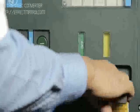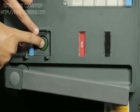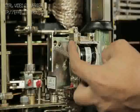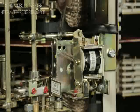For checking correct operation of the shunt release, charge the breaker. Close it with the closing push button. Trip the breaker as shown. Tighten the check nut on the connecting link with a spanner as shown.